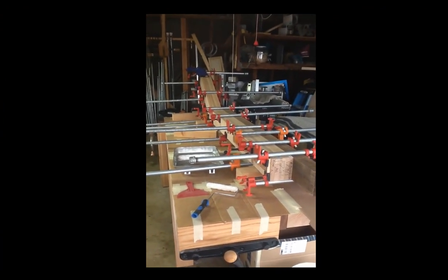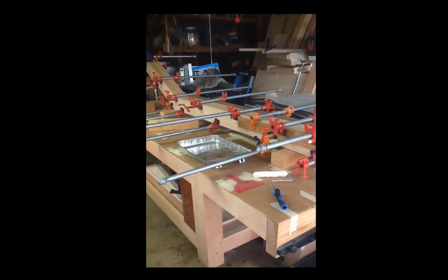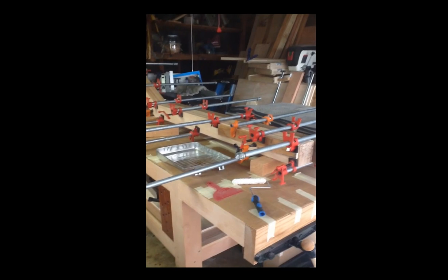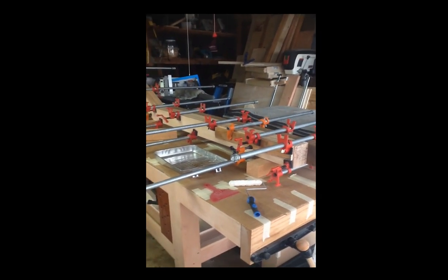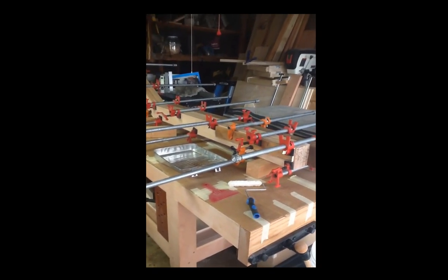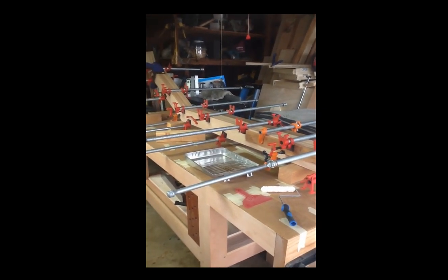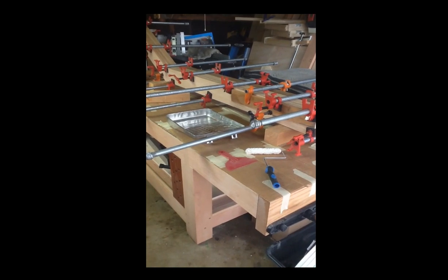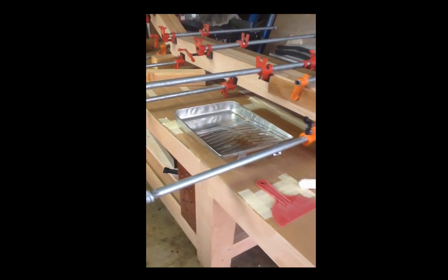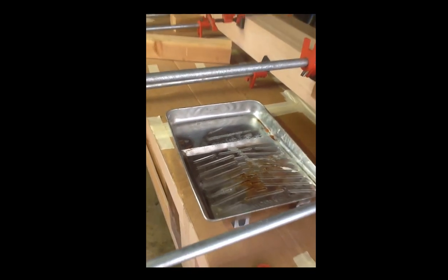Here we are — we're all glued up. When I'm gluing, I was always taught it's really best to glue both sides of anything — even a tenon. Glue your tenon and glue the mortise also; put glue on both surfaces. It just assures a better bond. I know a lot of guys just glue one side and it holds, but when you think about it, you glue one side really good and give a good tacky coat on the other side. For a long piece like this, about six inches wide, I'll always use a roller. For big areas like panels I'll use this kind of squeegee — I cut teeth into it — then go back over with the roller to make it nice and consistent.